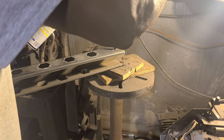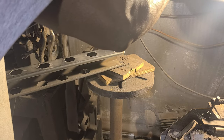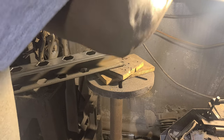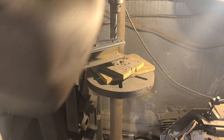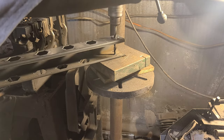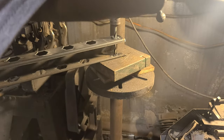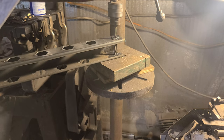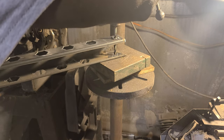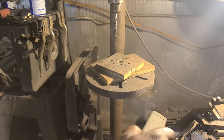What I also end up doing is drilling them out to a half inch. I use a three-eighths first and then drill out to a half inch. The reason is that the vinyl insert I put in there is half-inch in outside diameter, although it has a three-eighths hole. I raise it up because I want the holes to match up, be straight and square. I do this on both ends to make sure the holes match up on both sides so nothing is off and everything is straight and square.